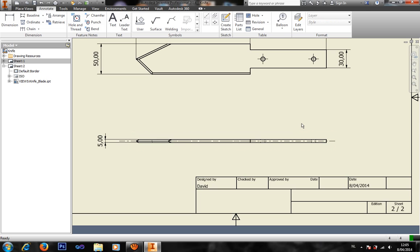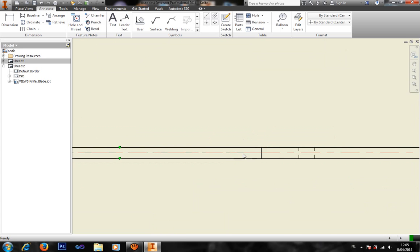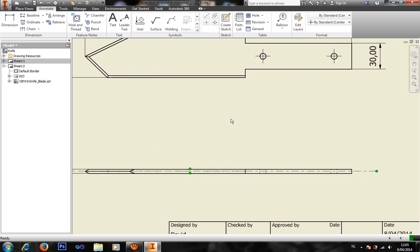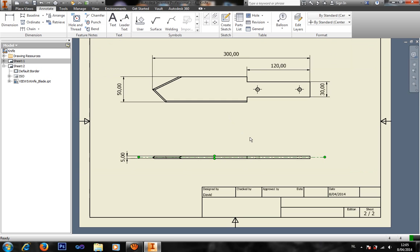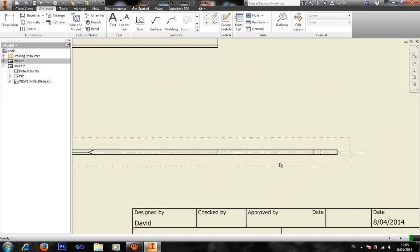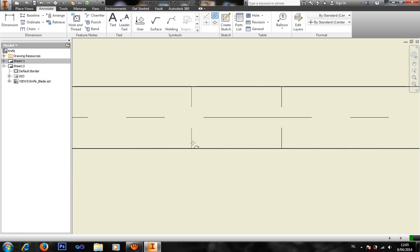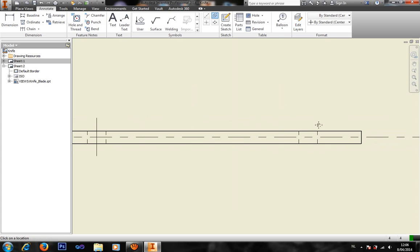The line that I just drew was to indicate that these two parts are symmetric. So every time you encounter a symmetric part, you should do that. It's just a standard rule, so keep that in mind. Oh, forgot one thing. The side view also projects the holes that we drilled, so they also need a central line.